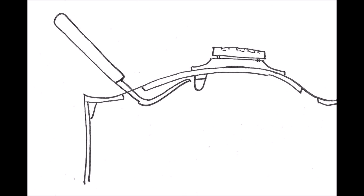The geometry is more complex than at first glance, as the top is arching upwards and away from the F hole. It's very difficult to come up with an angled tool for applying glue that will follow that angle and also allow you to slide back and forth and keep contact with the soundboard, because the shape and distance of the F hole from the brace continually changes as you move along its length. Try it sometime — you'll enjoy it.